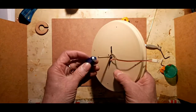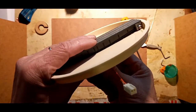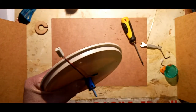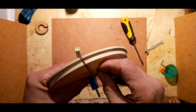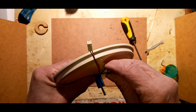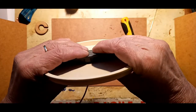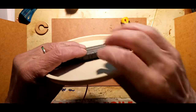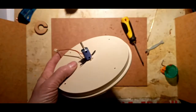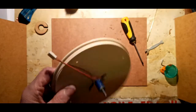So we slide it with the taper on first. Then we push it down until we fill the gap, not all the way, you want about a millimetre there. And then you just tighten up the blue one. Just nip it to start with, and then have a look and a feel. Make sure that you can slightly stress or flex it. Look on both sides, and if that looks okay, then you can go to the other key on the other side, and nip them both up.